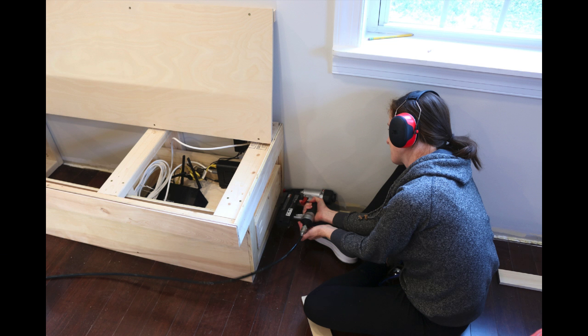It's important to spend a lot of time trimming out the rest of the bench because this is what's going to make your final product look really great. You'll need a circular saw, a table saw, and plenty of 1/2 inch plywood to cover the whole bench. Don't worry about nail holes or seams. You're going to use wood filler on everything before you sand. Do pay attention to any exposed plywood edge and apply edge banding. Even if you paint, I recommend edge banding all of the plywood edges that are going to show.